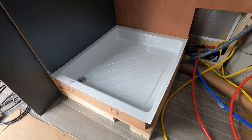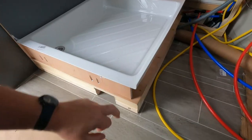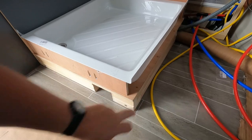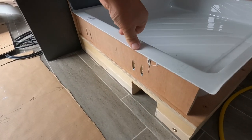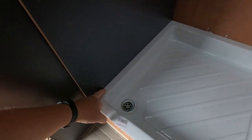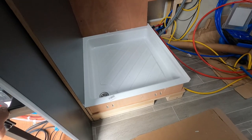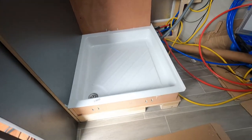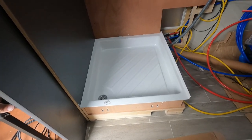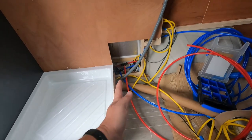The shower tray is now in. We put loads of Sikaflex underneath and basically glued it to the base plate, which is screwed down. We've also added some 12mm ply on the edges, pocket-holed in, because the tray was quite wobbly all the way around - one piece there, one up the side, and one along the back. Now when you push on the sides they're nice and solid. Before we glued and screwed everything down I chucked a full bucket of water in to test all the waste connections - everything was working fine, which saves any issues further down the line.